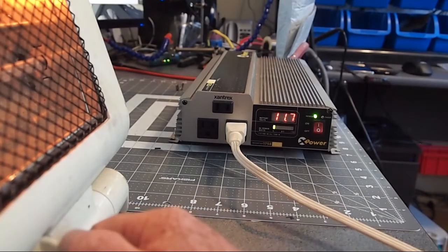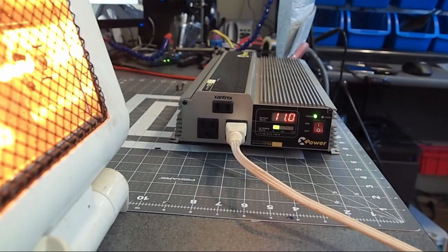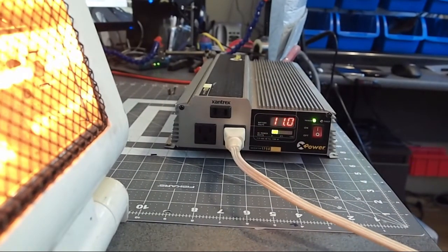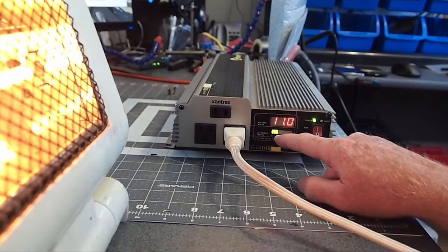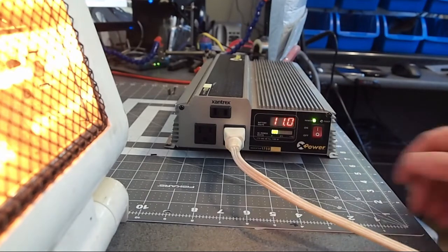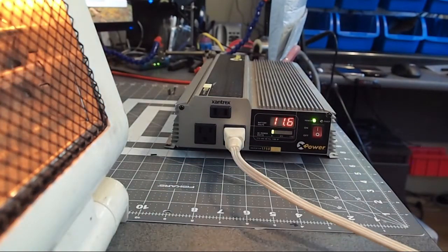and now I'm going to move it up to 1500 watts of load. You can hear that the inverter is telling you you're right near your low voltage cutoff. It is supporting the full heater, but the voltage is just getting down to the point where it's telling you that pretty soon you're going to have to shut off. You can see here down here, here's your bar, which is telling you your AC power in watts that is being drawn. And there we go. So while your battery can hold up to 11 volts or above, you are going to get the inverter functioning properly at 1500 watts.